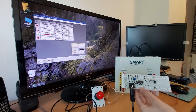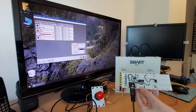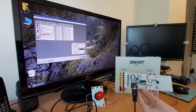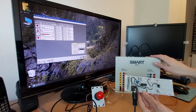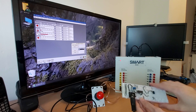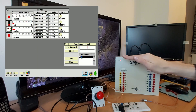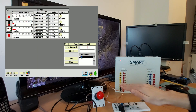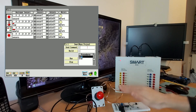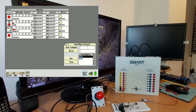To continue this demonstration, I'm going to introduce this analog sensor that I've put together. It acts like the user adapter that allows you to feed an analog voltage straight into the Smart Box to measure, and connected to that I've got this IR reflection sensor. As I move my hand down towards it, the reading from the adapter increases until very close — it maxes out. If I move my hand away, it goes back down again, so you can tell that there's something in front of it.